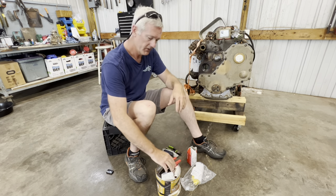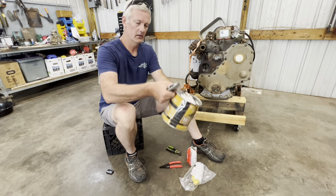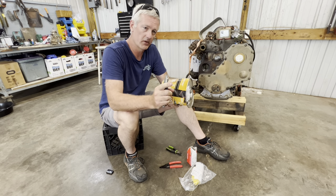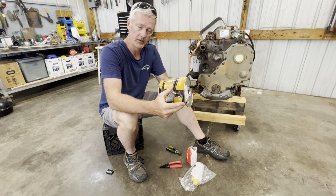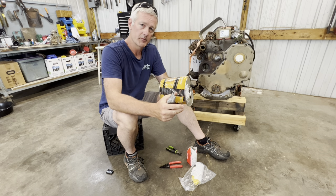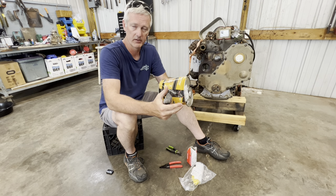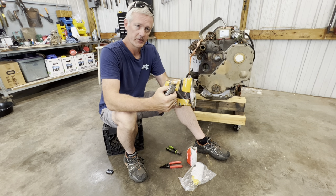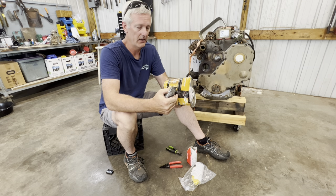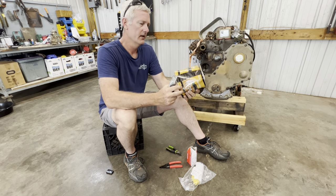So what am I doing today? I've got my generator up on my flybridge and I'm making an extension cord that's going to go from my generator on the flybridge down to where my shore power hooks into my boat. I've got two 30-amp twist lock connections on the side of the boat where shore power comes in and feeds the boat. I'm making an extension cord to go from the generator down to those outlets, and I've got a splitter that's going to bring it into one wire.